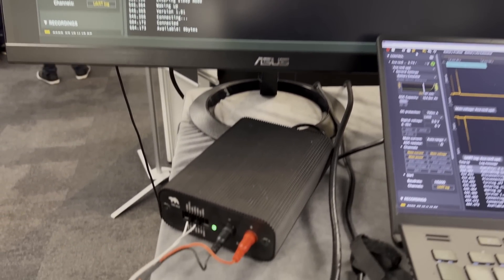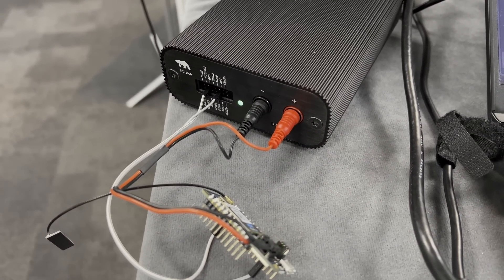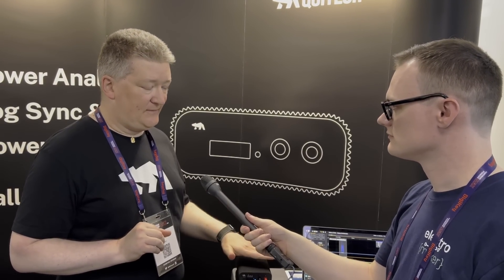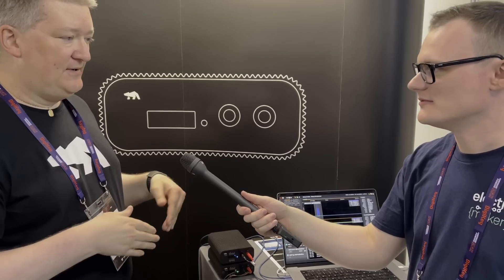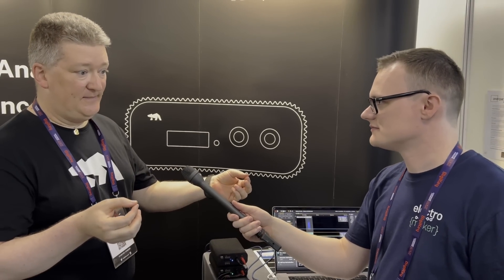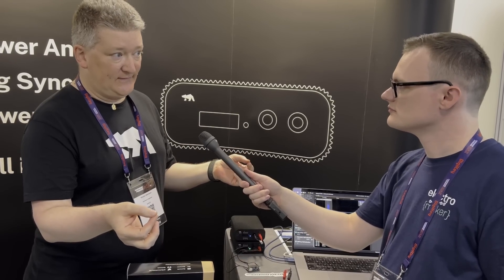Time-wise the samples are smaller on the ARC, but resolution-wise they're roughly the same — it's a 400 picoamp step size, 0.4 nanoamps of resolution on the current measurement. That's very small — smaller than most people expect. There is some noise, but the resolution is that fine, and the accuracy is 0.05%, plus 25 nanoamps of offset potentially. That offset is what typically gets you when measuring 100–200 nanoamps. A regular multimeter has 10 megaohms of input resistance — at 3 volts that's 300 nanoamps of leakage. This device is super high impedance, so you don't have to worry about it.